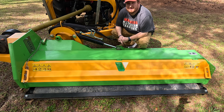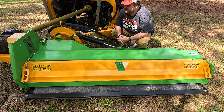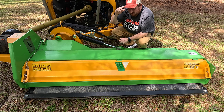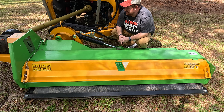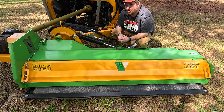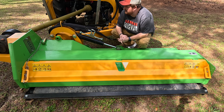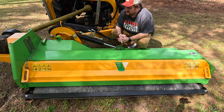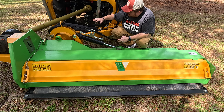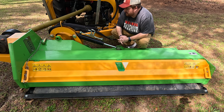So this here is my mower. It's a Victory Implements EMHD 78 — an embankment flail mower. She's a beast, about 2,000 pounds. You've got to have a pretty good size tractor to control this thing. But with that comes a lot of hard movement with the hydraulics. The mower can swing out and go up and down, and it can really shake you in the cab. It can really make you feel like the tractor is about to be thrown over on its side. So what I originally did was put some pilot valves in the lines in the middle of the flow to kind of help me control that.